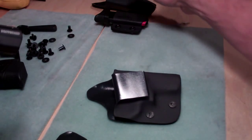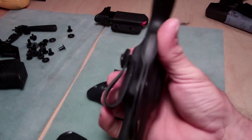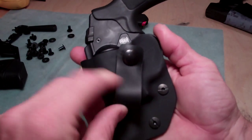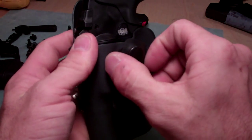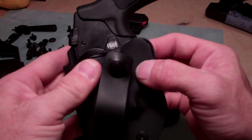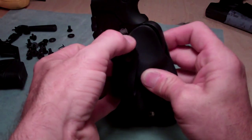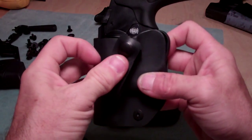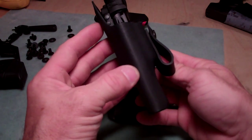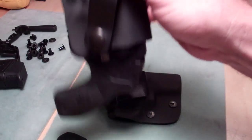This is a right-handed holster, but since I'm a left-handed shooter I made my own personal left-handed holster — it's the exact same, just a mirror image. I put a rubber belt loop on it to try that out, and it works pretty well. You can adjust the cant and it doesn't move because the rubber has good friction against the kydex. You unsnap it over the belt and snap it back. It also has retention screws and a locking mechanism — that gun's not coming out.